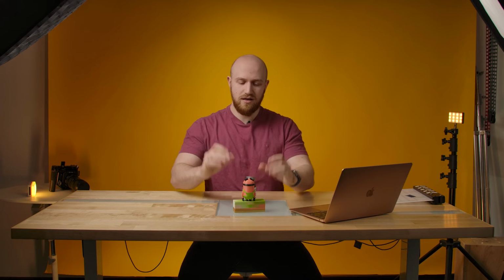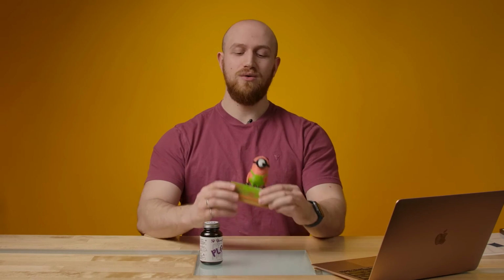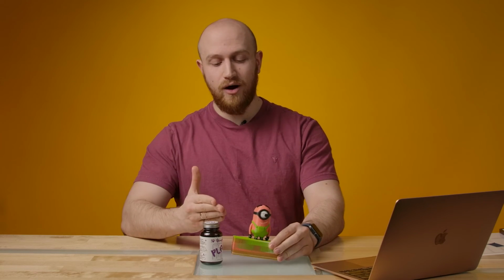And that's it. To increase your adhesion, if you wanted to do that, you can actually sand the parts, wash them with some soap and water so you get a nice clean surface and contact area, and try again. That's it, Joe. I hope this helps you. Just make sure that you leave these parts to cure for about 24 hours so the PLA really has time to melt and bond together to make that really strong connection.